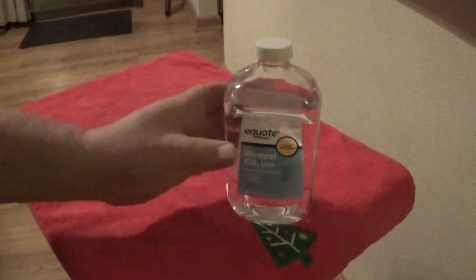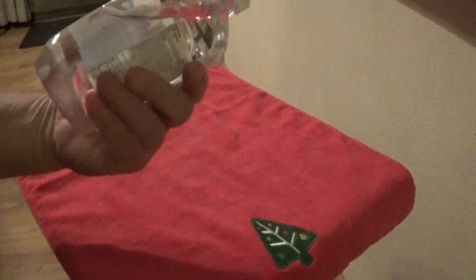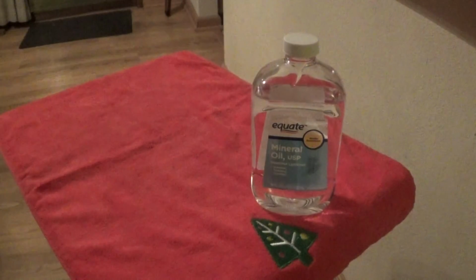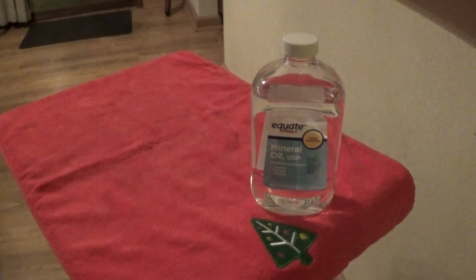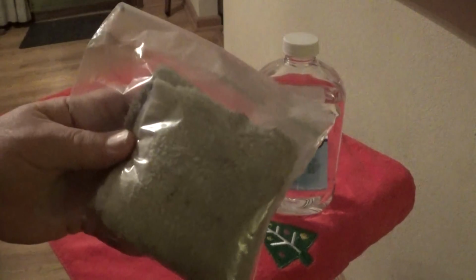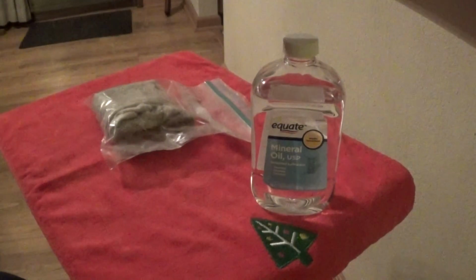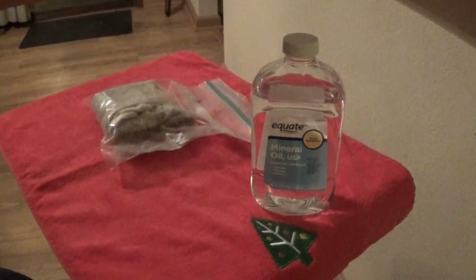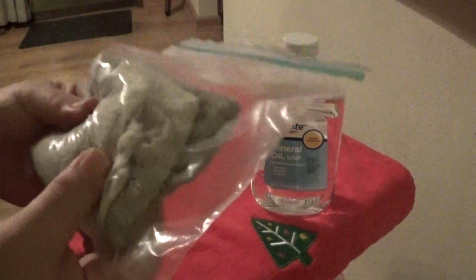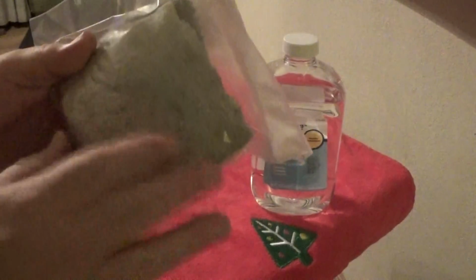And I've seen other guys on different YouTube channels, and they pretty much promote the same thing. It's just mineral oil. That's all it is. What you do is you get yourself a rag and put it in a sealable plastic sack. Get yourself a little eyedropper, suck it up and put it all over the rag, then distribute it through the rag by wringing it out. Once the rag becomes saturated, granted, you don't want it dripping with oil. You just want enough on it so it'll leave a film, but that's it.